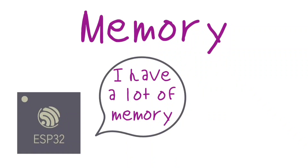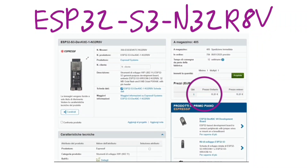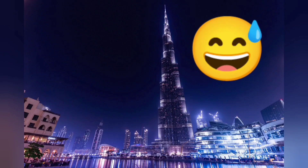Now let's talk about memory. Most of these modules have a big flash memory, like 2 MB or more, and up to 32 MB for the ESP32-S3 N32R8V. What a long name — this dev kit will cost you 15 euros, by the way. The big memory size is obviously a great feature when you have really big projects in mind, although if you need 32 MB of flash, please tell me your project.